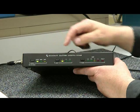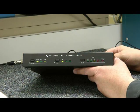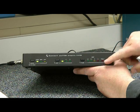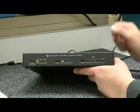This is the tune mode. If you're in the manual mode, hit the tune button and it'll find the lowest SWR. Here's your SWR indicator, and a fault light. If it doesn't find a tune, the fault light will light up.